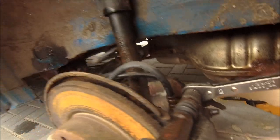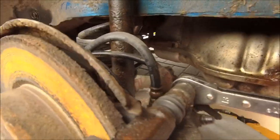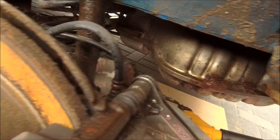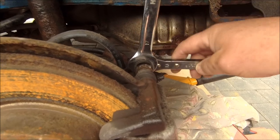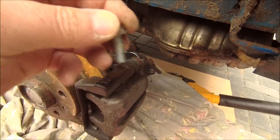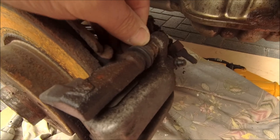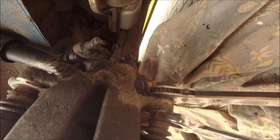So again, two bolts at the back. The slide on this side was stuck last time. We've got a 13mm on one side — but for the other I'm going to need to grab that, let me check the size... yeah, 17mm. I'll need two hands for this. There you go — one bolt out. So it's 13mm on that side and 17mm for the gripper. The slide on this one is pretty good. There's the second bolt — that's all you need, take those two out.